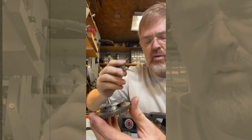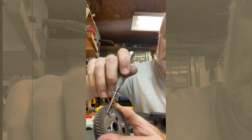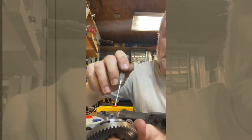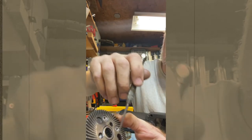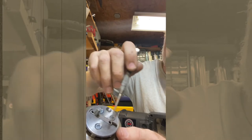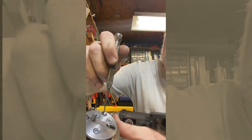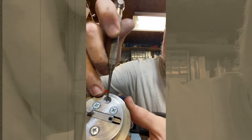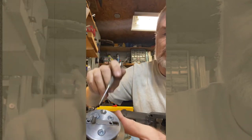I went back and looked at the video and I had let the gear drift out of the camera frame, so you couldn't see what I was pointing at. I was trying to point out that this shelf I made had to fit in along that side — part of it had to be just the right diameter and it had to all be one piece so that it would press in there. That took me a long time. Also, I've got two inserts that went into the pre-cut holes on the original gear — they'd taken those out for weight. I had those drilled and tapped, but ended up not using them because I decided I didn't really need three screws there. I also had cut out a spot and planned for a screw there, but I realized it wasn't a completely flat surface — there was a step — so I decided to leave that out and go with three screws, which I think is going to be plenty strong.